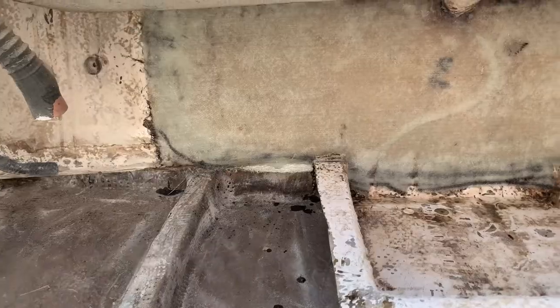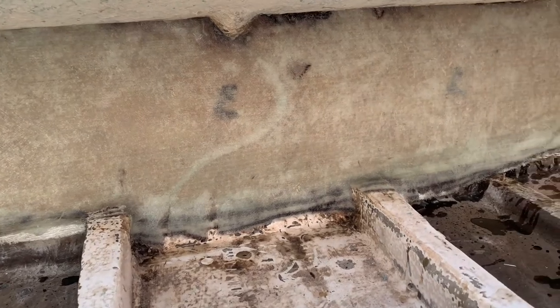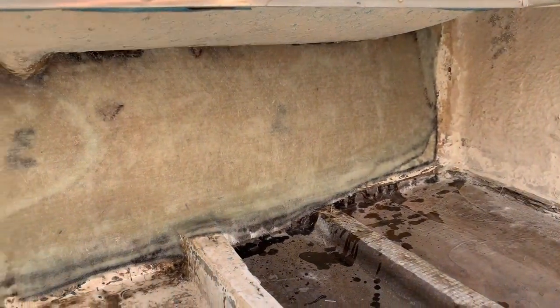Side of the boat on the transom is all fiberglassed in, three layers of fiberglass, and it looks good. It was a lot easier to lay in. I flipped the mat over and I used a different roller, and those two things together I think just made it so much faster and easier to do. So that was nice to learn that on layer number 9, I think I'm on. So I have the floors to glass in. Maybe I should have started with the floors, but things are moving along.